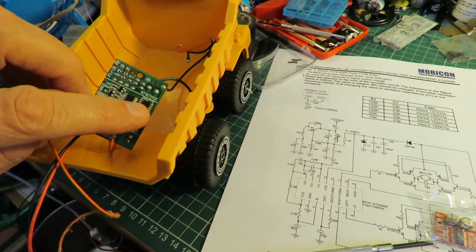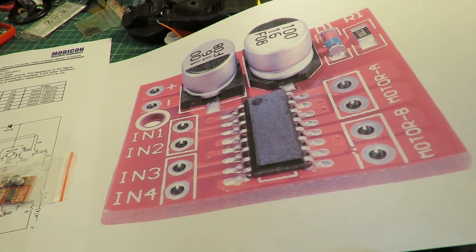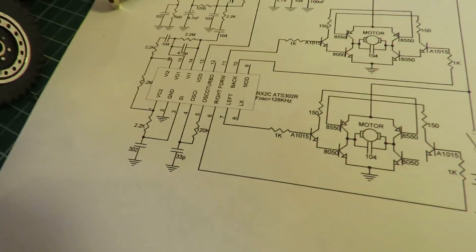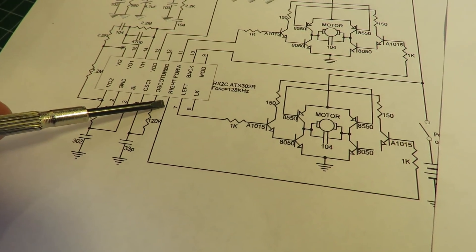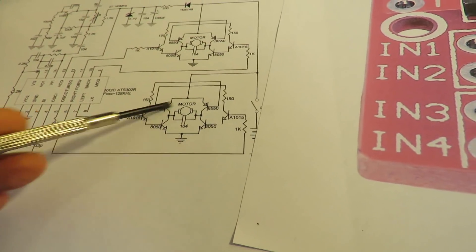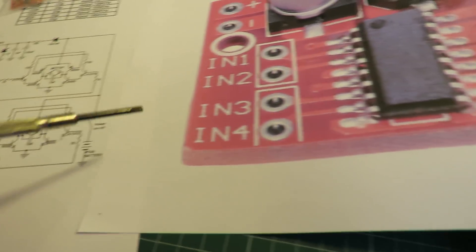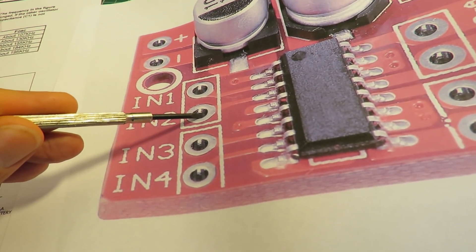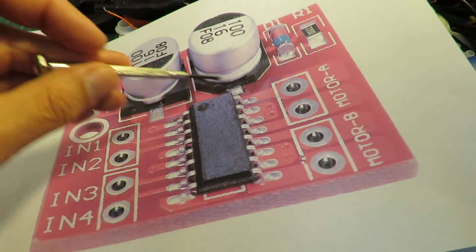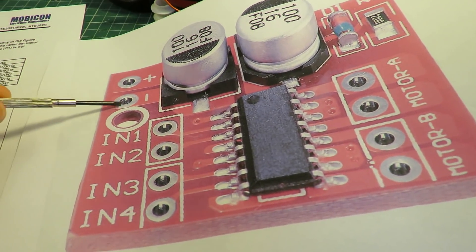Being as I think I've only burnt out the steering motor controller, I'll only need half of this, but I need to try and intercept pins 6 and 7, which come to the H-bridge there. I need to intercept that where it comes out and feed it into inputs 1 and 2. On the face of it I can put virtually any voltage I like there, within the restrictions of what this one can carry — I think on the advert it said up to 10 volts.